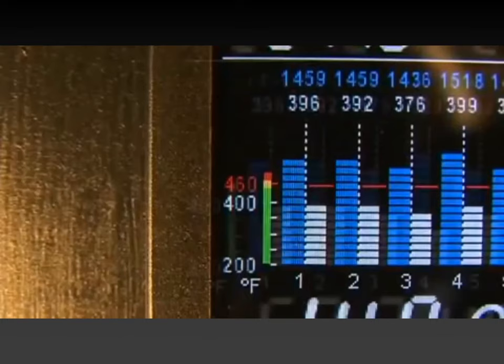Absolute EGT is only something you care about in a turbocharged engine because turbine inlet temperature always does have a red line. You don't want to run the turbocharger too hot. But since we are not turboed and we just throw all the exhaust overboard, there is no hard red line for EGT per se. What we're mostly concerned with is relative EGT, EGT relative to peak temperature.